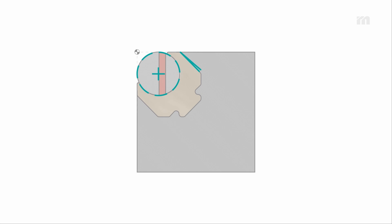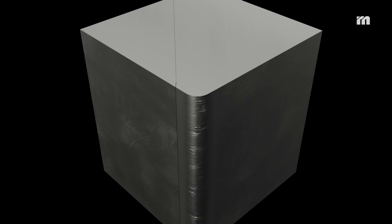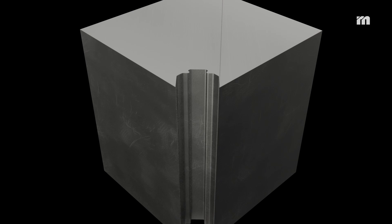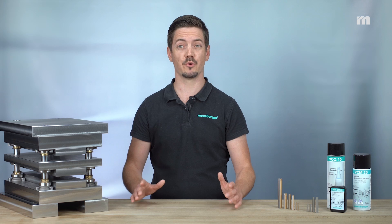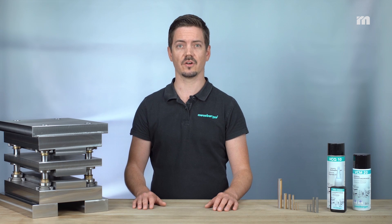It is important that the bending unit is inserted at a 45 degree angle. The contour can be provided in the bending punch or the die by wire EDM. Make sure that the contour is manufactured precisely with a G7 tolerance — this is the only way to ensure an optimal fit of the bending unit.